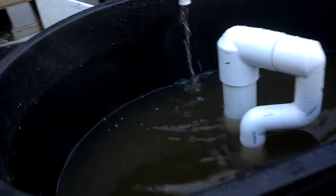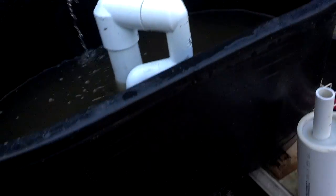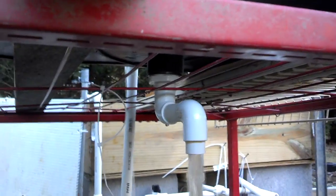One of the other tweaks — and like I said, this is 2½-inch to 1¼-inch — is putting two bends in the pipe below the bed. They don't have to be there, but it's just part of perfecting the above-bed siphon.